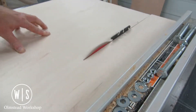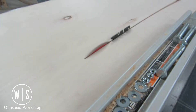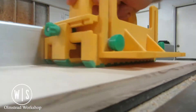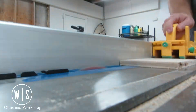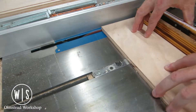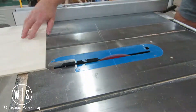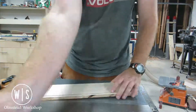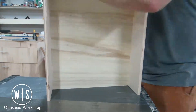At this point it was time to get busy building some drawer boxes. I used very simple construction with half-inch ply, cutting dados to capture the bottom panel which I made from quarter-inch ply. With all the fronts and backs cut, I did half lap joints to hold the sides on — these are just simple shop drawers so I wasn't looking for anything fancy. The drawer construction used a bit of glue into the dado slot for the bottom panel, then gluing and brad nailing the sides on.